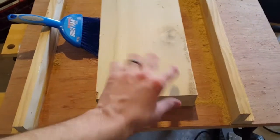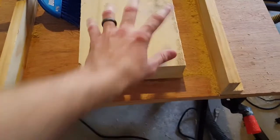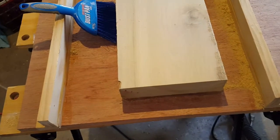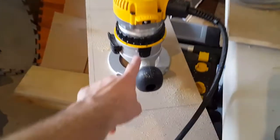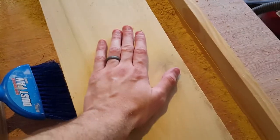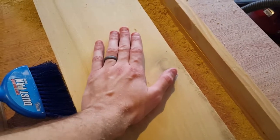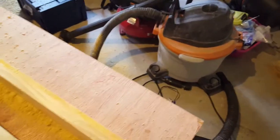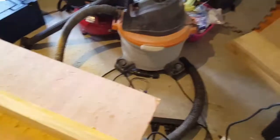This is the first surface planed. Since it was a little wobbly, I'm going to take the glue off, flip it over — it should be completely flat — and apply the glue again. One key note: I did not change the height of the router. I set it aside and it sits so the bit has a little cavity to rest in. When I flip the board over, the bit should be at the absolute surface on the other side.